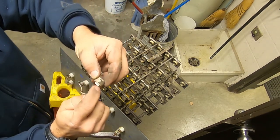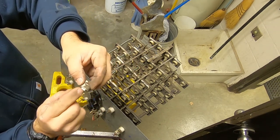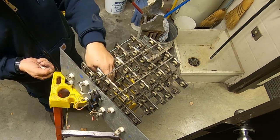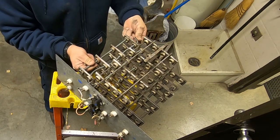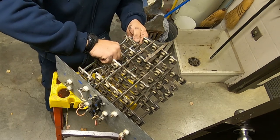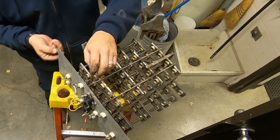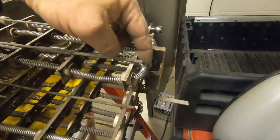You can see here they've got a little square edge on the back that holds the electric element and it comes on through. You may need a little more of a stretch, but it's easier to stretch it than to shrink it — once you stretch it too big it doesn't do so well. You've got to be aware of what your wires are getting close to because there's metal all around it and that can make a snap, crackle, pop. Make sure you don't have any sags or dips, and make sure you've got plenty of clearance around the metal framework.